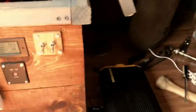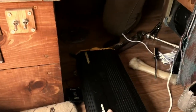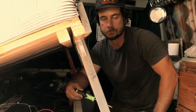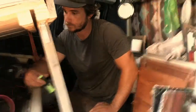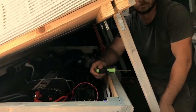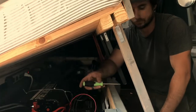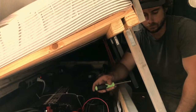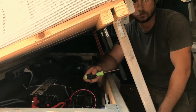Really, this inverter was just charging our cell phones and running this little fan that we have. And our TV. And that was on a very small fraction of the day. And then we have just a small mini fridge-freezer that was running off the 1000 watt inverter, and that little was just too much. So I think people should just go with the pure sine from the start, that way they don't have to do what we're doing.